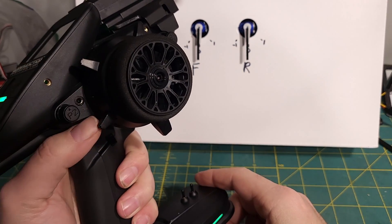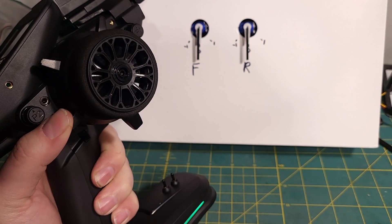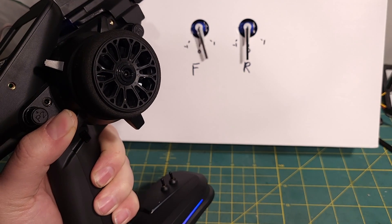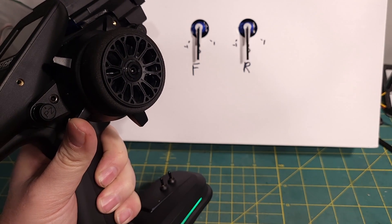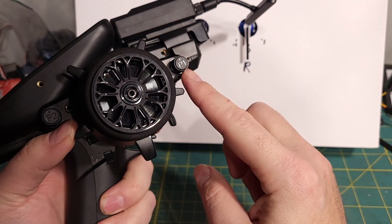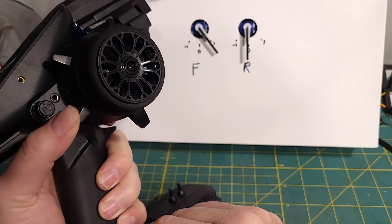On this trim switch I've got dig and burn set up. If you're going along and want to do dig, hold it down — now only the front motor is active. Hold it up for burn — only the rear motor is active. So that's the main settings: change your percentage split with this knob, and do dig and burn with this switch.